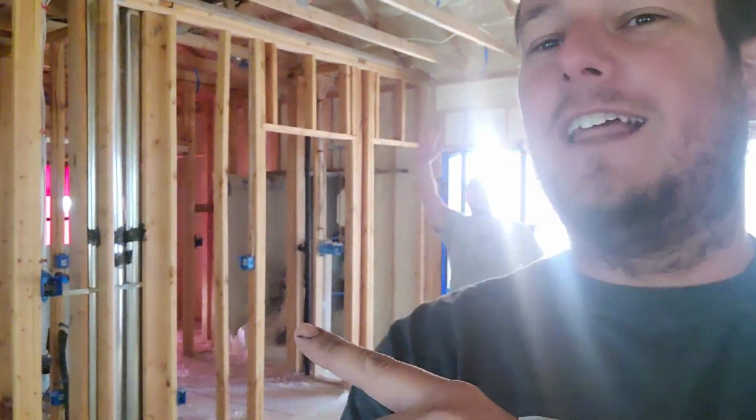However, because we're already at 1.74, the AeroBarrier guys are pretty confident that we can get down to passive house, or 0.6 ACH 50. Airtight Solutions is amazing. This is Paul with Airtight Solutions, and he's one of the guys that's going to be sealing up the house, and he's confident we can make it airtight. So we're excited to see how it goes, right, Paul? Yep, very excited. But we'll take you along.